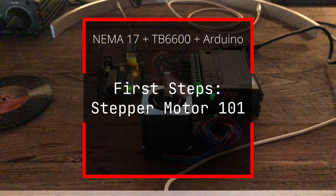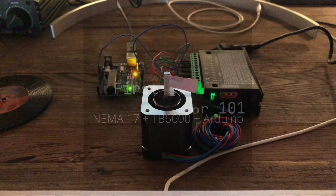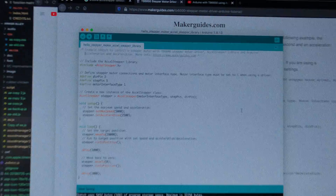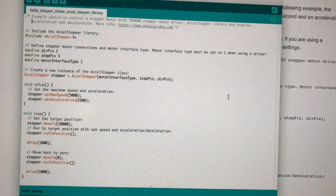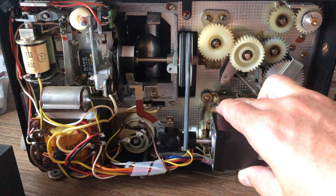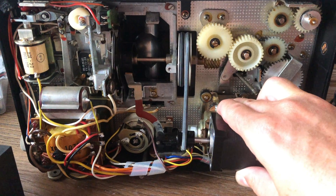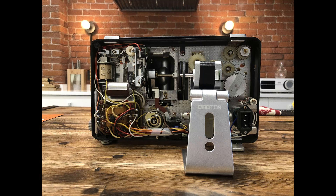This project has a lot of moving parts, and I mean that literally, so I thought it would make sense to start with one. I decided to use a stepper motor to drive the projector, because I can very finely control the speed and do things like acceleration and deceleration. So using an Arduino and a handy library with a TB6600 controller, I can drive the motor at variable speed. When I got the stepper motor running, I just did a quick test alongside the projector, holding it against the pulley, and it works great. The stepper motor's got no shortage of torque.